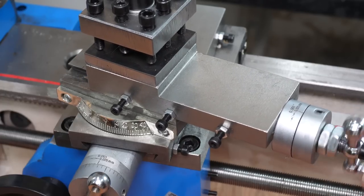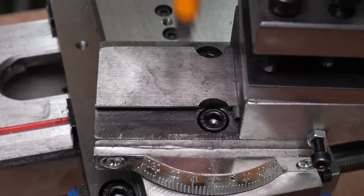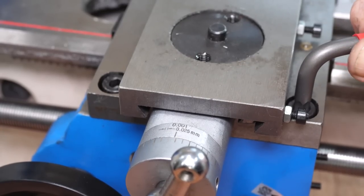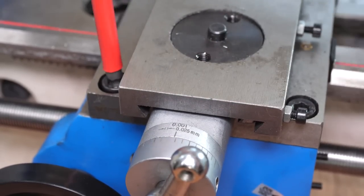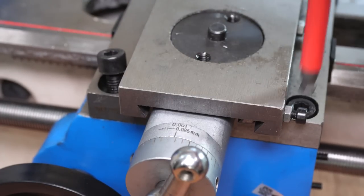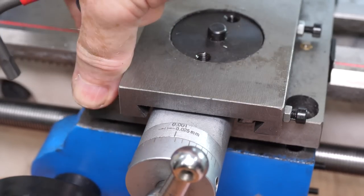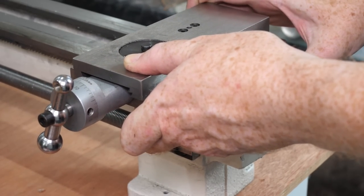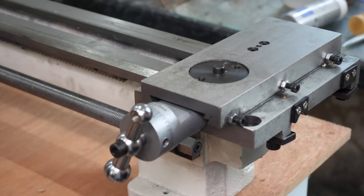The compound needs to come off first, and needs to be pulled all the way back to expose the two screws holding it in place on the saddle. The next two screws attach the saddle to the apron. Removing these will allow the saddle to move freely and slide off the end of the bed, leaving the apron engaged with the feed rack and lead screw. The saddle sticks a bit at the end of the bed — it looks like this is due to stray paint on the slideways, especially on the underside. The hold down plates on the saddle are at a strange angle, which I'll need to look at in more depth later.